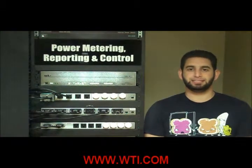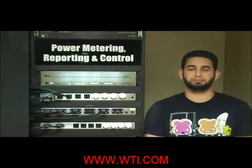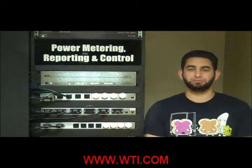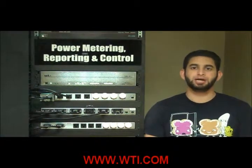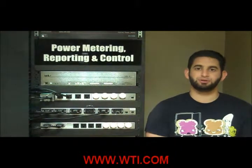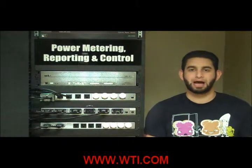Your standard IEC C13 outlet is rated anywhere from 200 to 240 volts, up to 16 amps. The difference between these two outlets is the amperage and the voltage range. Your standard IEC C13 outlet will run anywhere from 200 to 240 volts, but it can be under-voltage rated to run anywhere from 90 to 240 volts. Your standard NEMA 5-15 or 5-20 can run from 125 volts down to about 90 volts, and can also be run anywhere from 15 to 20 amps depending on the outlet style.